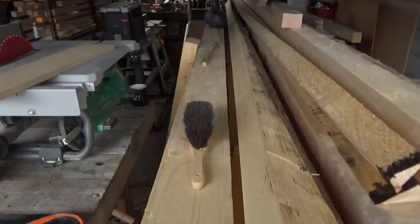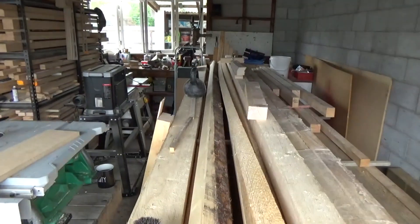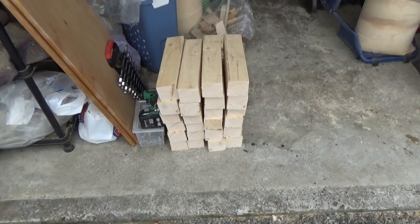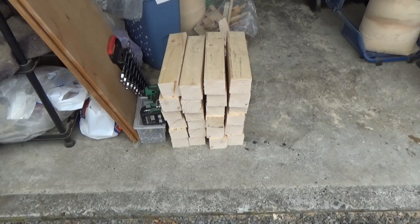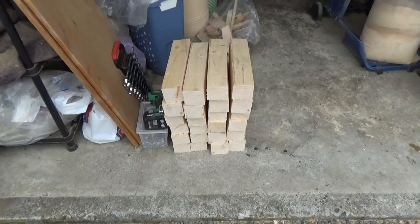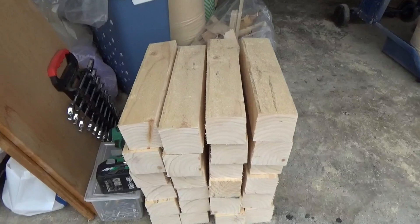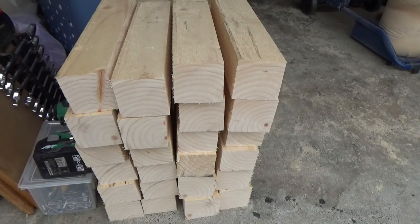While restacking, I came across this piece which is fundamentally warped — it's twisted around that way. So I'm going to cut that up for firewood. A pile of firewood from a four-and-a-half metre beam of spruce timber. This beam had quite a twist in it — wasn't worth keeping. What I've found in previous ones is where you've got the core of the tree, it tends to twist around that, and you can see the core of the tree in several of these rings. So that'll be burnt over this winter.